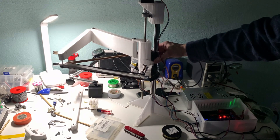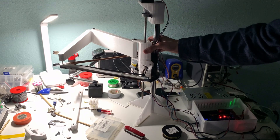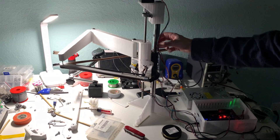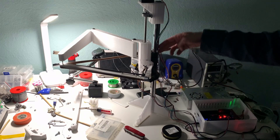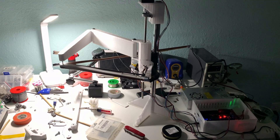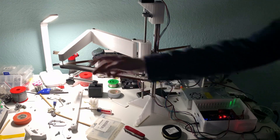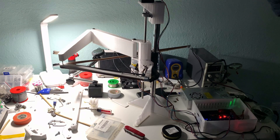The Z axis is extremely straightforward — it's just a lead screw. No need for spring-loaded nuts because this thing is heavy enough. This is a cheap linear rail, 20 millimeters, very stiff. Ideally I would want to screw something behind it, but it's the stiffest thing in the whole system, so I don't really care much about that. I checked it with a gauge here — push here — it barely flexes. So I think I'm fine on that.